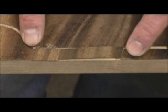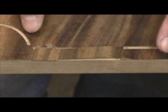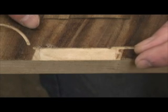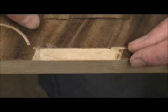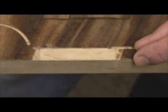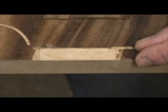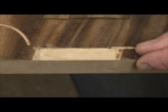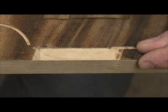I didn't just cut it square — I tried to cut on the slope and grain lines to further disguise it. The only reason this is going to work is because of the swirling nature of the crotch mahogany in this area. The pattern is kind of indistinct and it disguises minor variations. Also, there's going to be an inlay around the edge here, so that's a very narrow strip that will have the patch — very inconspicuous. If this had been straight grain mahogany or something like curly maple or bird's eye maple, there's no way — I would have been buying more veneer and doing the whole drawer front over, and in fact all the drawer fronts, because the pattern had to match between adjacent drawers.